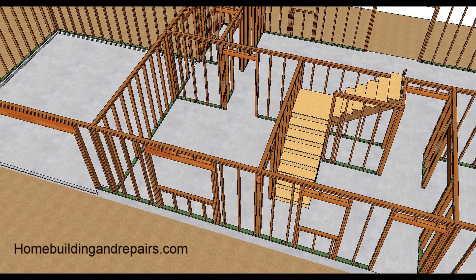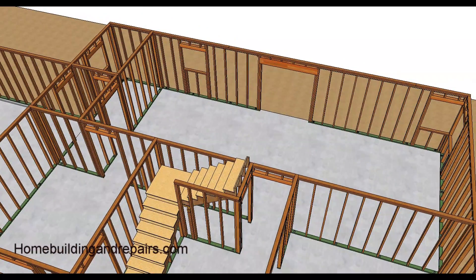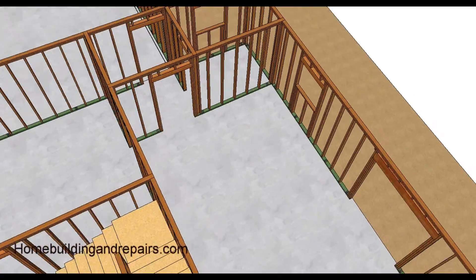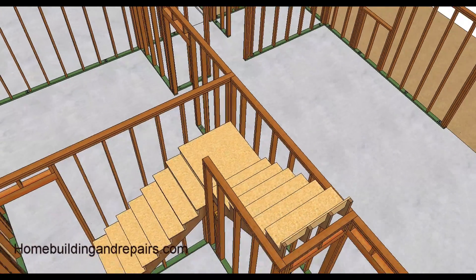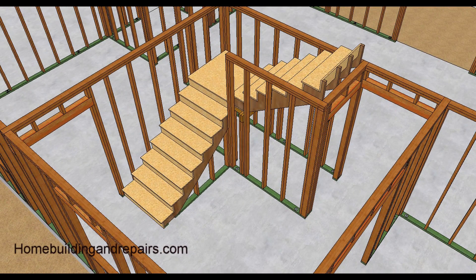Here's the dining room and kitchen area. This gives you an idea of how the top plates connect together, as well as the wall framing and the anchor bolts. We usually use a powder-actuated pin — a little gun that shoots pins into the concrete — for interior walls. These are spaced no further than six feet apart.